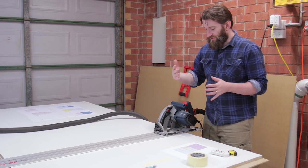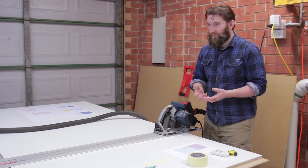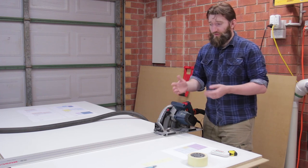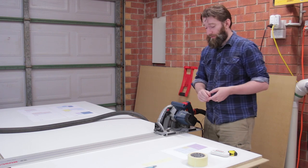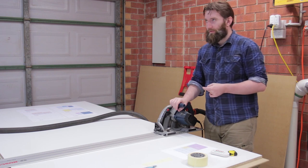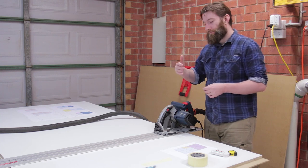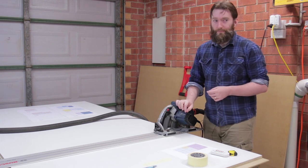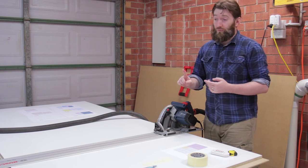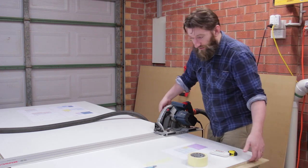The next thing to talk about is the tooling. This is not going to be a minimal tools build but I'll try to provide alternatives for the more expensive machines. In this case I'm using a track saw because I don't have a circular saw — this is my only circular saw and it does a great job. A 16mm thick sheet of melamine weighs around 25 kilos, so it's much easier to break it down before pushing it through a table saw. If you don't have a track saw you can make your own tracks — I'll have links in the description below. Kreg also have the Kreg Rip-Cut which attaches to your circular saw and gives you a wider guide.